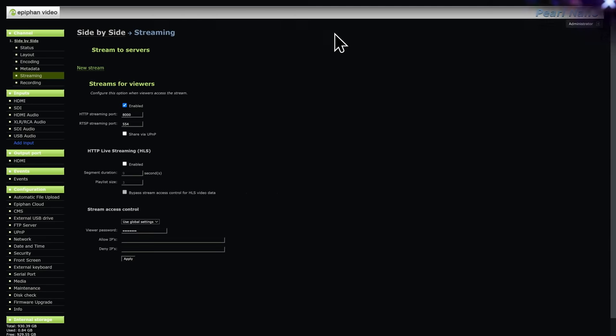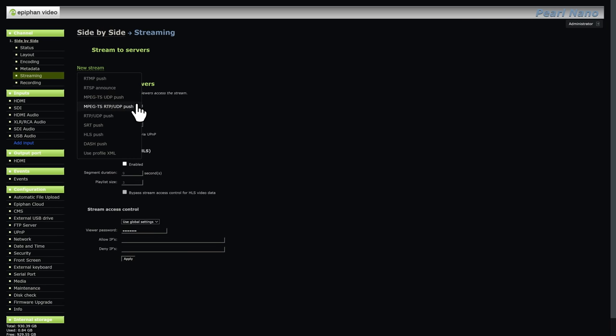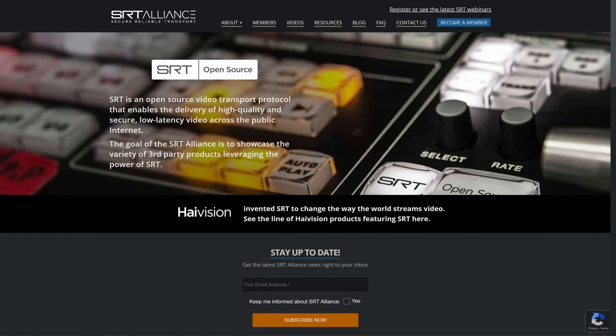In terms of streaming, this box supports RTMP, HLS — which you can now send to YouTube — and even SRT, both in and out. So while you can obviously use this box as an endpoint with an HDMI video switcher like the original ATEM Mini to broadcast up to YouTube, Facebook, Twitch, or any other video site, you can also use it to send to other streaming setups with SRT — Secure Reliable Transport. SRT is a secure way to package up high-quality video and audio to add into other streams or broadcasts, kind of like NDI but it can go over the internet as well. With SRT, you can send the Nano's feed to another big Pearl box or to a whole streaming PC setup — just between nodes in a greater broadcast setup.